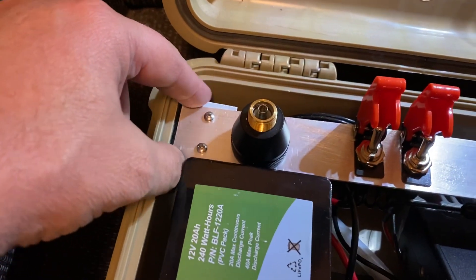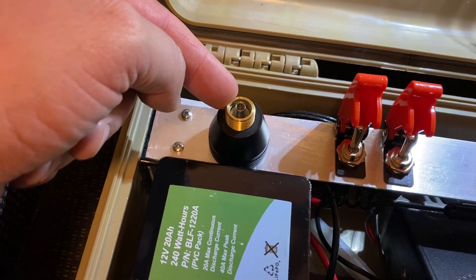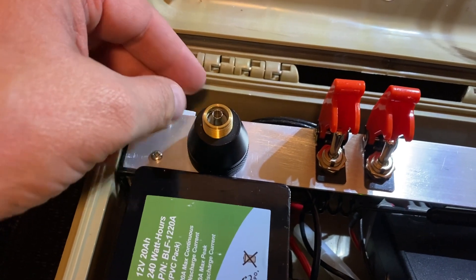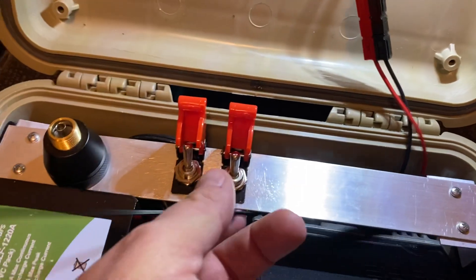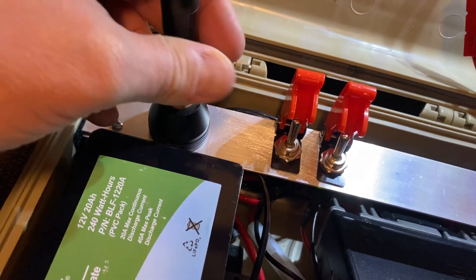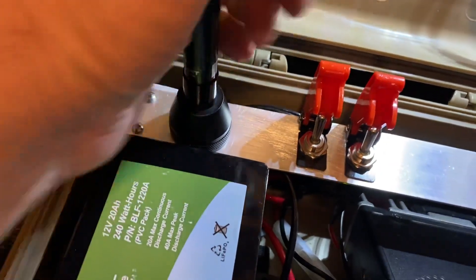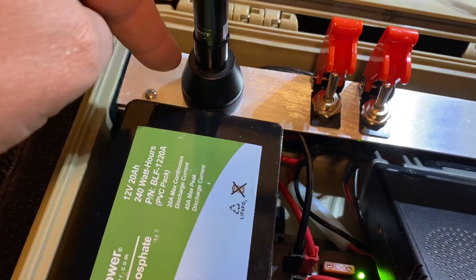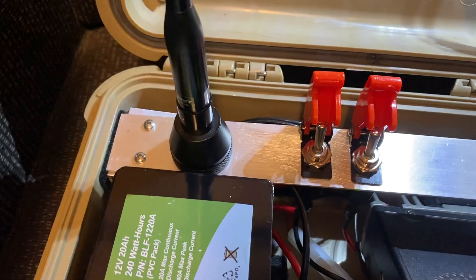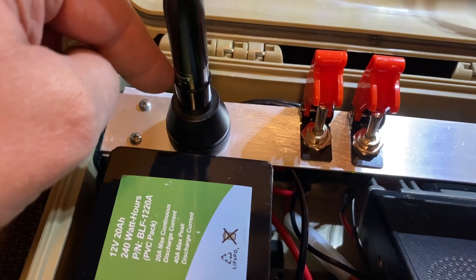This panel here has the antenna mount on it — it's actually an NMO, and this is an NMO to UHF adapter. So I can use either a UHF antenna or NMO. I have a small UHF antenna right here; it doesn't have great performance, but it's in the box and I like that the box is self-contained. I've also got a larger NMO higher-gain antenna that's been on my vehicle for years, or I can do UHF to an SO-239 coax and go to a mag mount. So these two adapters cover most of the antennas I'll want to work with.